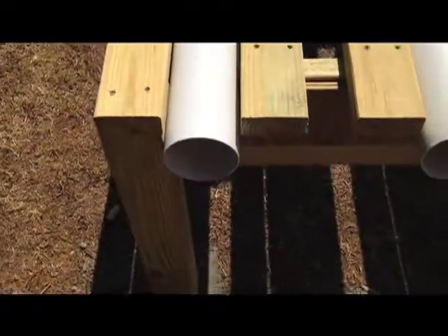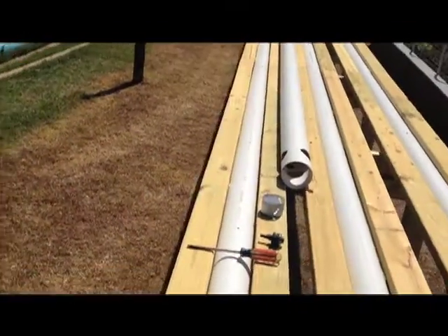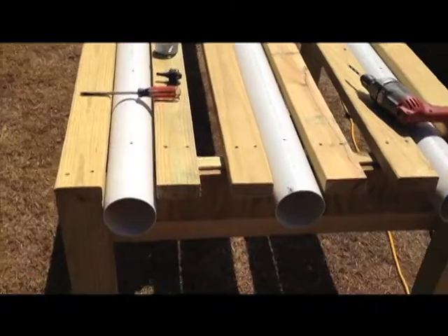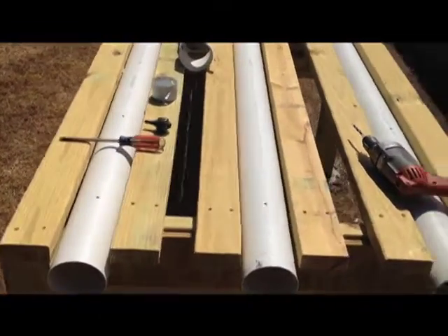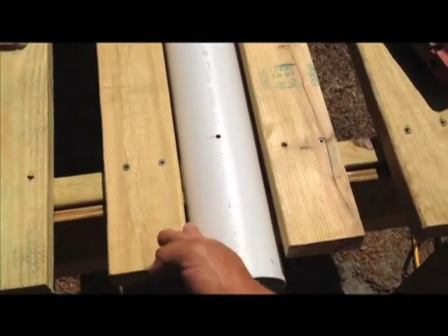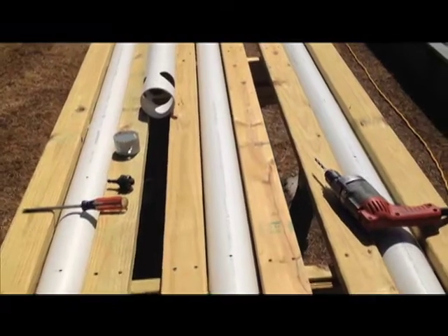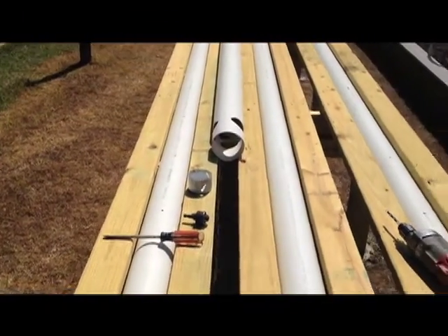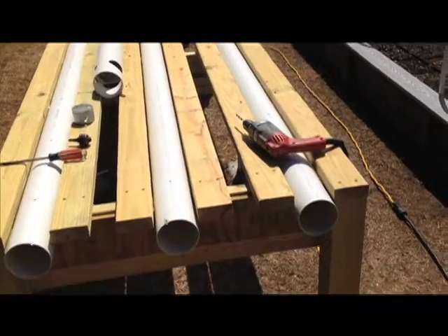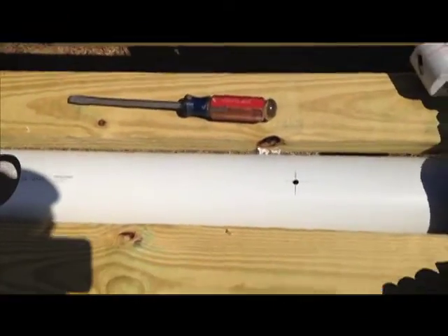The pilot holes are drilled. I've marked my pipe on the inside — left, center, and right — so when I remove these to clean them out, I'll be able to put them back in the same orientation. That's always a good practice: mark your pieces and put them exactly where they were when dealing with multiples. I'll show you one of these holes — how beautifully it cuts in reverse. I'll try it left-handed, try and keep the shadows off of it.